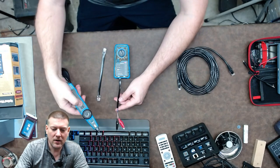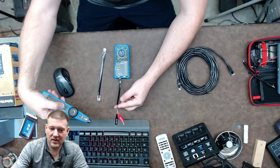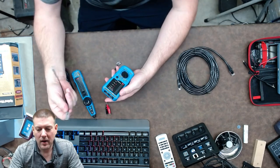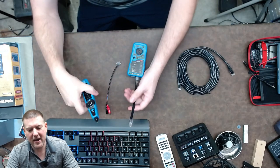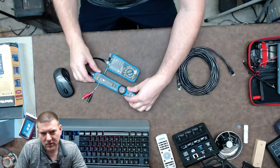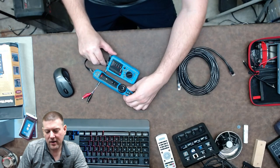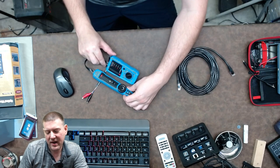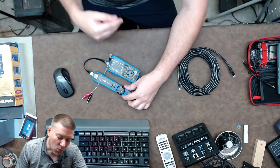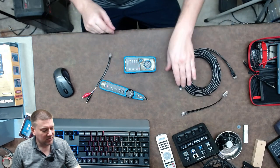Let's say there's a wiring harness inside your ultrasound and you want to figure out which wire comes through. If you can access one of your conductors, you can clip one of these on and use a signal tracer. We hit the scan, and even if you're within proximity, you can hear it. That is how you do a scan. We can also do a network test. What this test does is it tests all your conductors inside the cable, scanning them pin by pin.